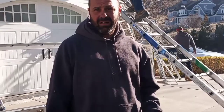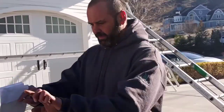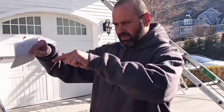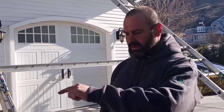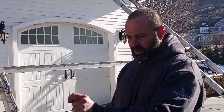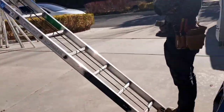Is there a proper way that you teach guys to do it? Well, when you lift the shingle up, you have to have the wire loop down a little and then over and then go up. You can't seal the whole shingle. You have to leave room for water to get out in case water gets in there. But then you seal around the hole. You pull the wire in and out and then seal it again, and that keeps it sealed. As long as you do it that way, you really never have problems with it.